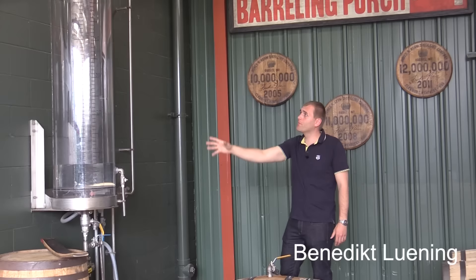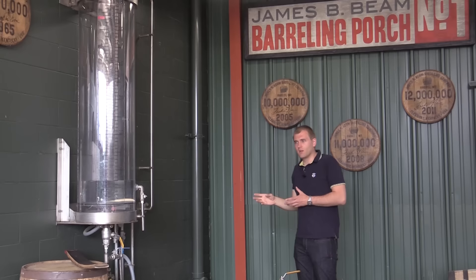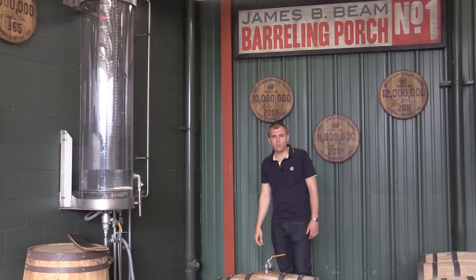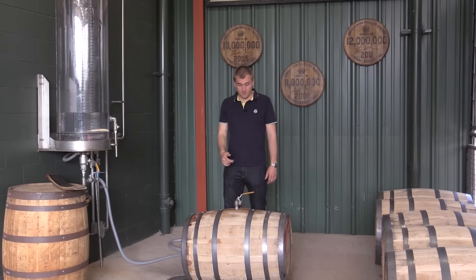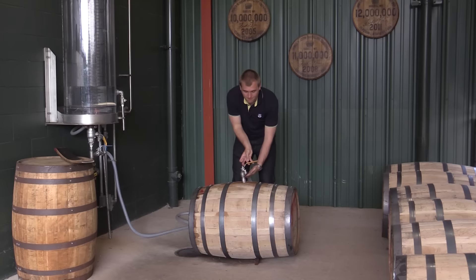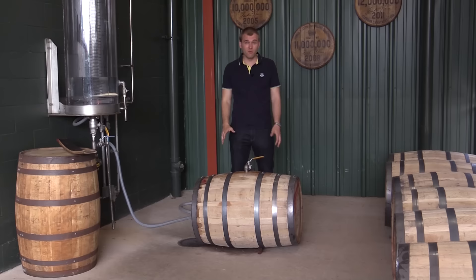This is where they fill the barrels — there's a huge glass tube filled to exactly 53 gallons at the red mark. The spirit from the still is diluted down from 135 proof to 125 proof, that is from 67.5% ABV down to 62.5% ABV. I'm going to fill the barrel now and have a little try. That is really high alcohol, really sharp — good bourbon needs its maturation, so this has to rest for at least four years.